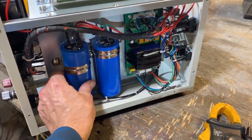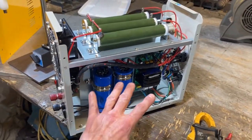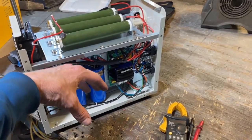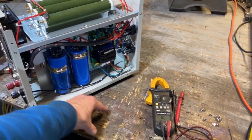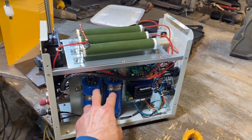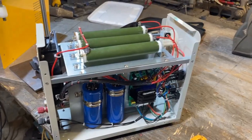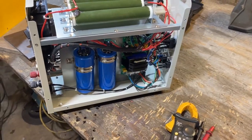At some point I plan to add more caps. On the bigger machines they'll have like five of these capacitors, and the machine will pull them in and out of parallel. The more in parallel, the faster and rougher it cuts. Sometimes they'll do a rough-cut pass for precision drilling, then turn off all but maybe one capacitor to do a finish pass. The fewer capacitors, the cleaner the hole. For tap removal and stuff like that, we'd be okay to have like four more of these in here.